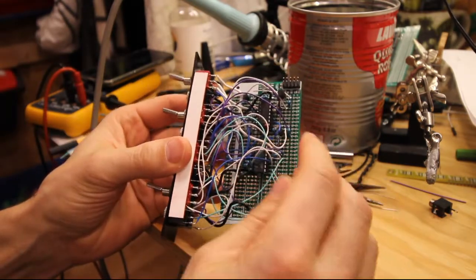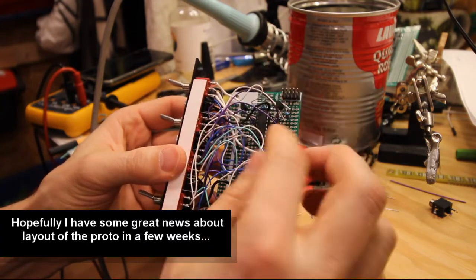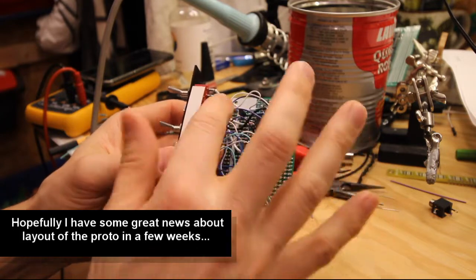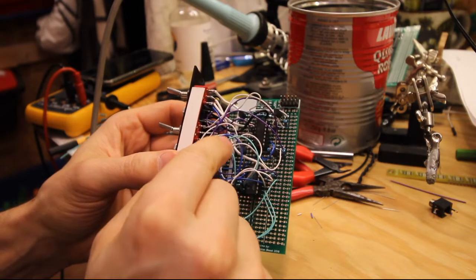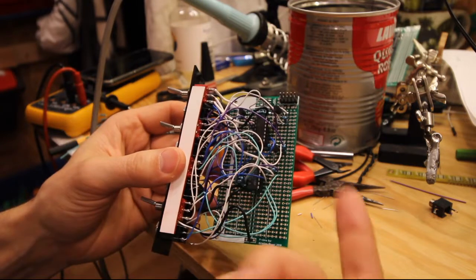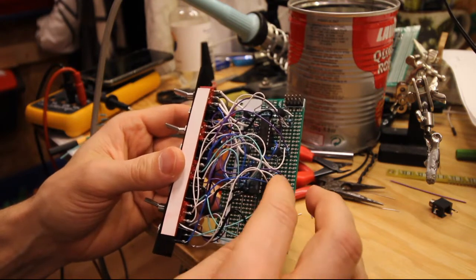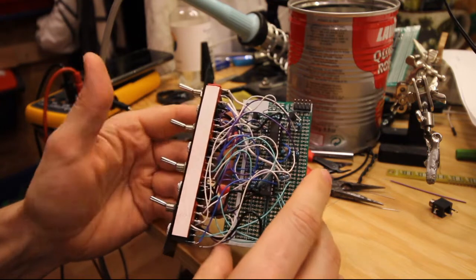And the proto board looks like this. I'll try to make a layout that you can follow. It's really easy to make on this board. You just make 4 of the inverters there, and the comparator up top, and then the 4066 down there, and just a few diodes and 1K resistors, so nothing much.